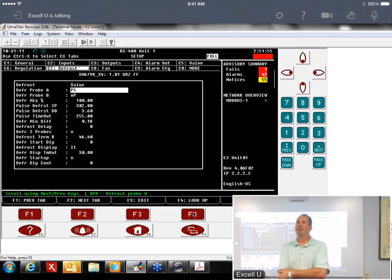They couldn't get a good reading on low temp cases for superheat. They moved the temp sensor to the center of the coil top. Okay, so that explains why there's a gap there. Yeah, they have fixed it. 553 is probably in the right spot.